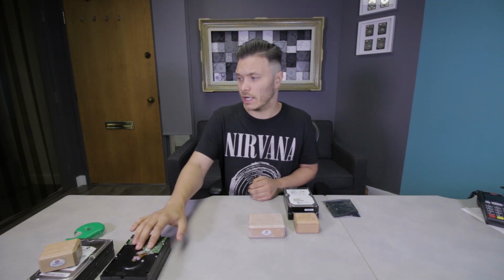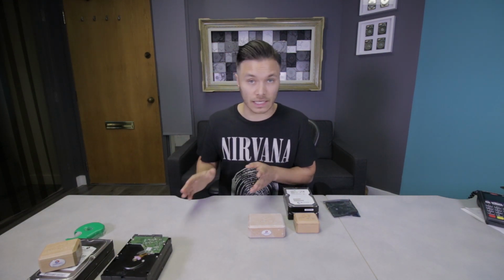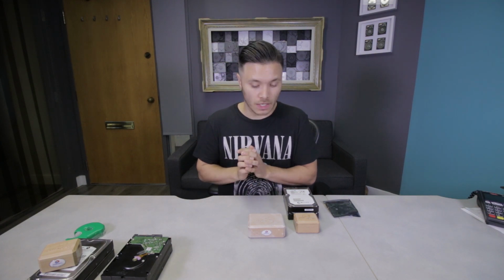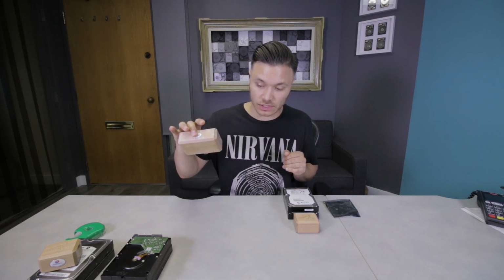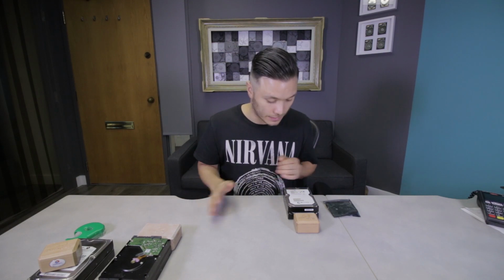This unit is not from a MyBook, it's from a network drive, which is probably gonna have some sort of Linux partition on it, but it's not encrypted, which is a good thing, because if it was encrypted, partial recovery sometimes would be a problem. And for this unit, the head extraction kit for Western Digital 3.5-inch does just fine.